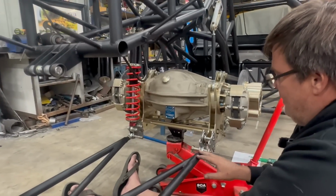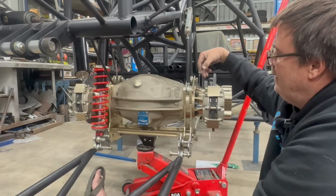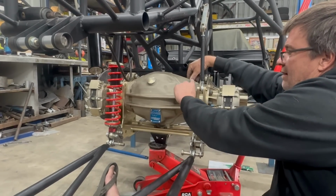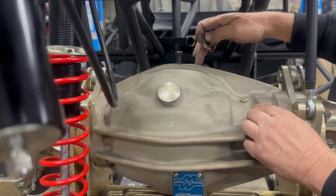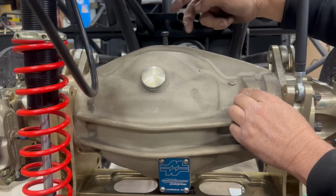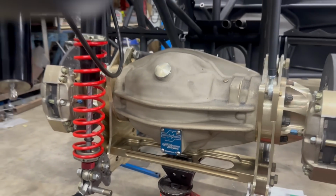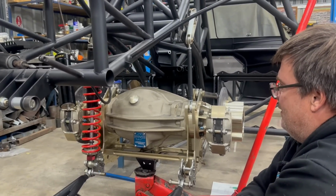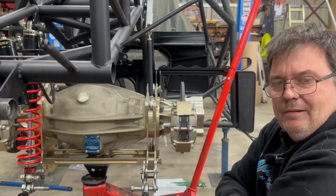The wheelie bars, it's looking good. The only other thing we've got is the 2 upper bars for the wheelie bar. So the only 2 holes left in the deal is we've got a set of holes here, so we're going to graft a bar into here, and then we've got a couple of holes up on top that are at a stagger, so we're going to put a little pedestal in there to level that up, and then we're going to send something off of here for those top wheelie bar mounts. So we're very close to having this arse end locked away. The next day or two, it's going to be all done, and the real business end is going to be ready to rumble.